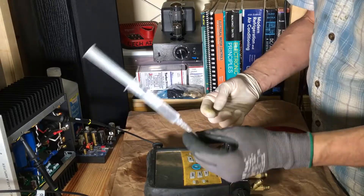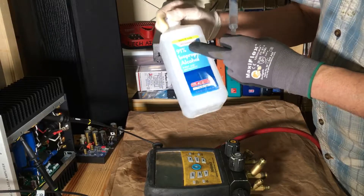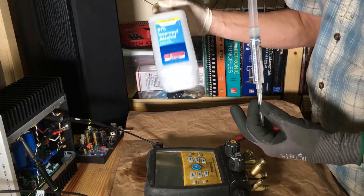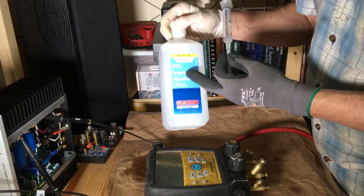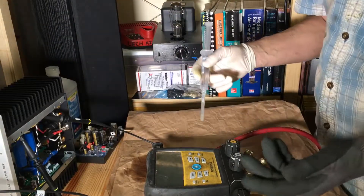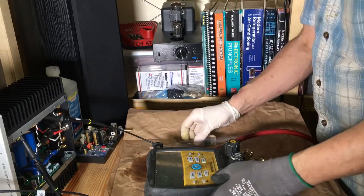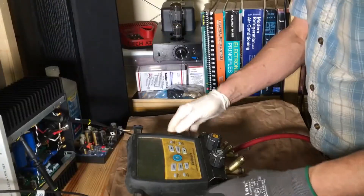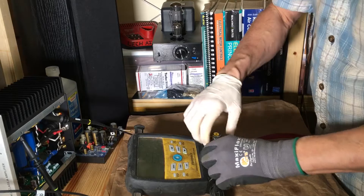We have a syringe injector here. Now, 98 or 99% alcohol is what I usually use, and I went up to get alcohol today because I used up the last of mine, and they had no 98 or 99%, so I'm going to have to suffer with 91%. Remember, the other percentage is water, and water is one of the things you want to keep out of here, but you will be flushing it out with nitrogen and then putting it on a vacuum pump, and the vacuum pump will remove the water. I'm doing this indoors, which I don't want to, but it's cold outside and it's like 8 or 9 o'clock. So let's go through this and make a mess in my place — I brought some rags, and I got nitrogen here.